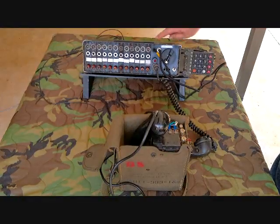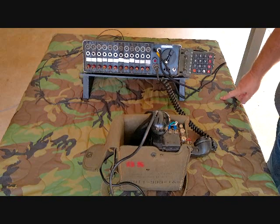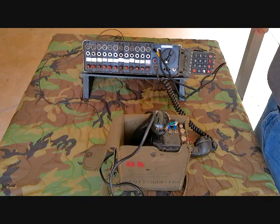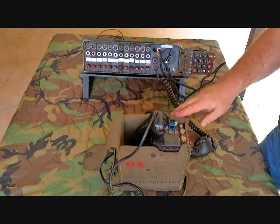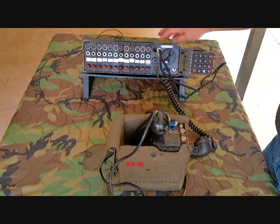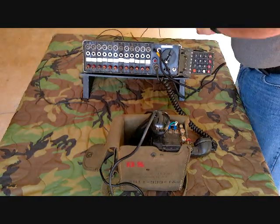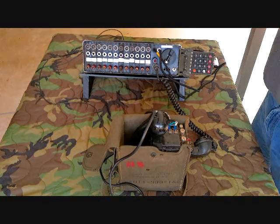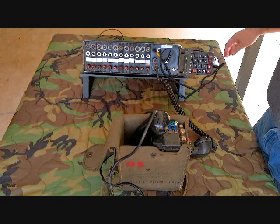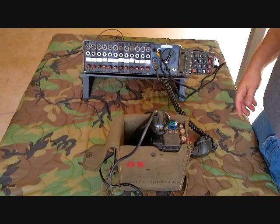I've got my SB22 set up. I have the trunk card installed and I have the TA-977 tone device hooked up to it. I have an EE8 plugged into line pack number one to function as the subscriber. All the subscriber phones on here are set for local battery, even though this is actually a common battery card. This trunk card is plugged into my home phone, so I can call between there and my cell phone. We'll demonstrate by making a call from the cell phone into the switch and transferring it to the EE8.